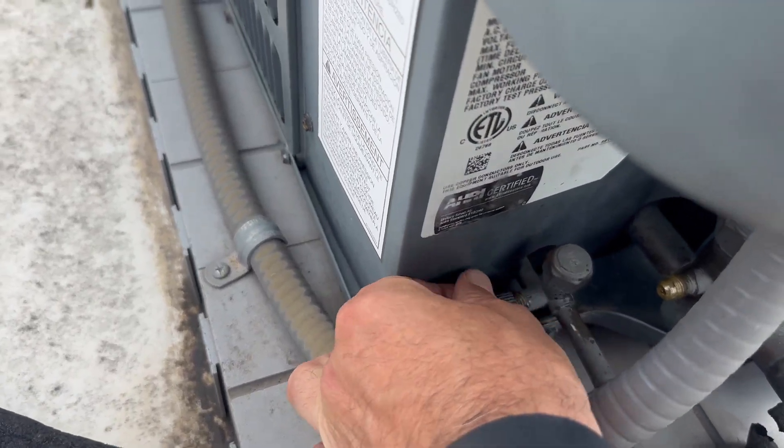Put my caps back on. The system is now cooling — for how long, I don't know: maybe a year, a month, a week. It didn't look like a huge leak, but I'm going to give the service manager and property manager the options: order a new coil, order a new system, put in some leak sealant, or braze the coil and try to repair it — which I've done before, works about as well as the leak sealant. I do have probes and clamps, and sometimes I tape the wire to the line to take the temp — it's not efficient, but that's how I learned.